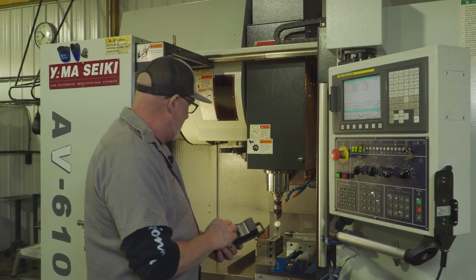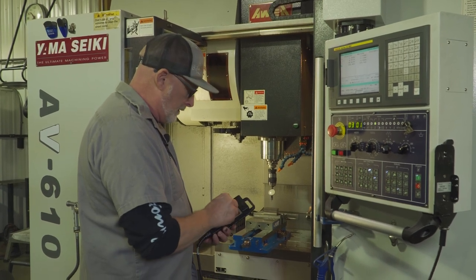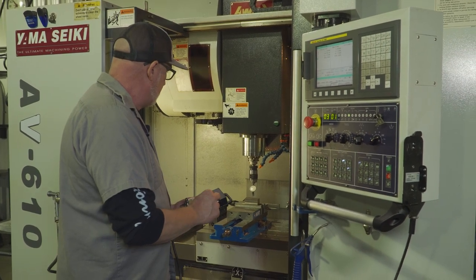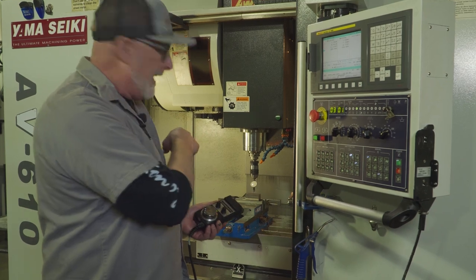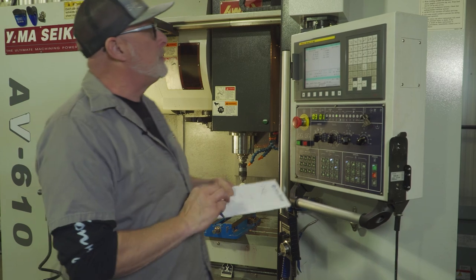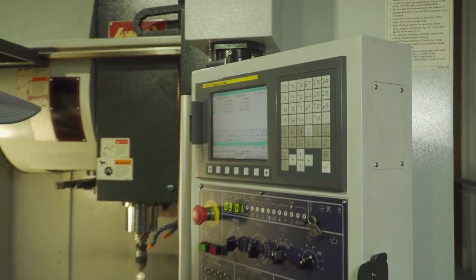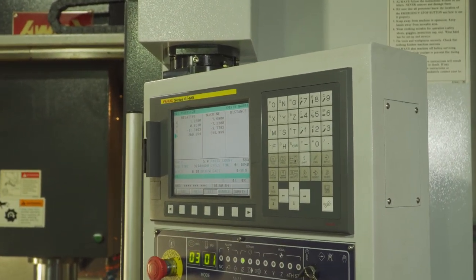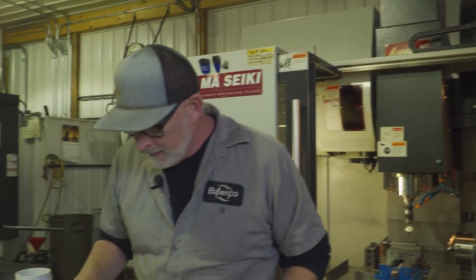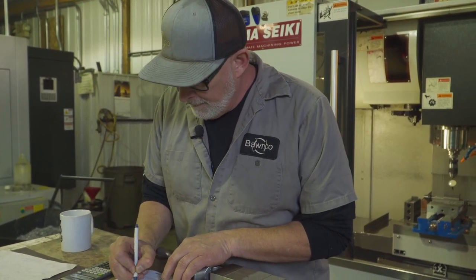I'm going to come straight up, over to my block. Now that it's reading, I go back to zero and write this number down — this is my fixture number. So minus 9.7793. I do a little math: 11.316 subtract 9.7793 equals 1.536.